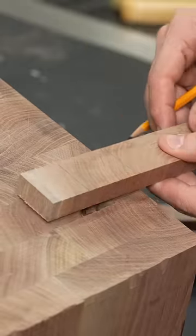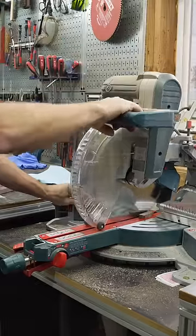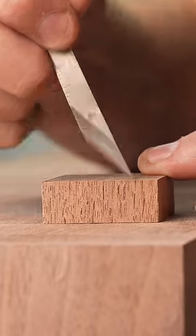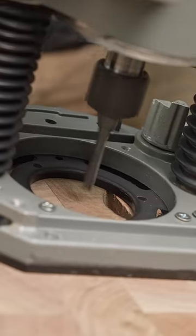When I got this base cut down to size, I found two giant knot holes that I wasn't expecting — that made me look like a suspect woodworker. So I'm going to attempt to hide those to at least look like a mediocre woodworker. How I'm going to do that is I cut two blocks; each one of the blocks is the same height as that row. Double-side tape it down, marked it with the marking knife.